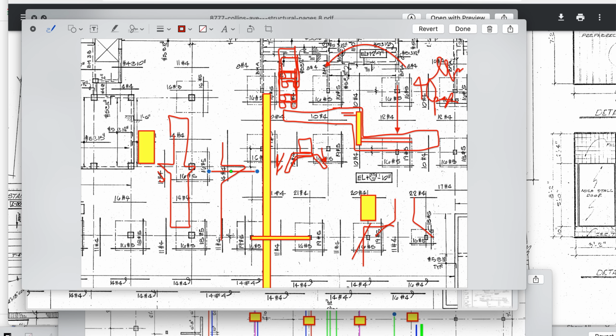So when they go after this original designer, yes, he removed the BMA, but he also made it clear that 40 pounds per square foot was his intent. 40 pounds per square foot doesn't seem to have changed anywhere in his drawings where he says, now you can give us 40 more, exceeding 40 pounds per square foot. And they seem like they did that with the deck loading of the materials, the concrete overlay, which is stamped, and then the concrete and the weight of the pavers. So it seems like they exceeded it without even allowing human trafficking onto the deck. Yes, again, I love to say human trafficking.